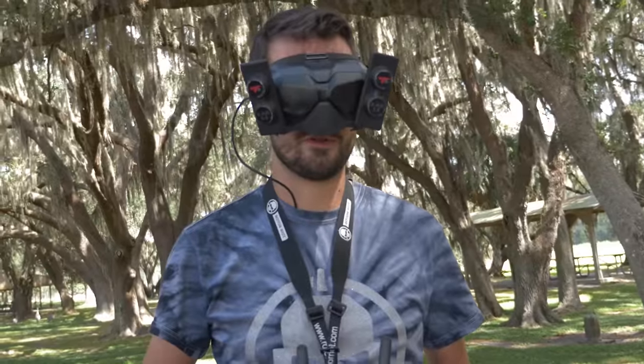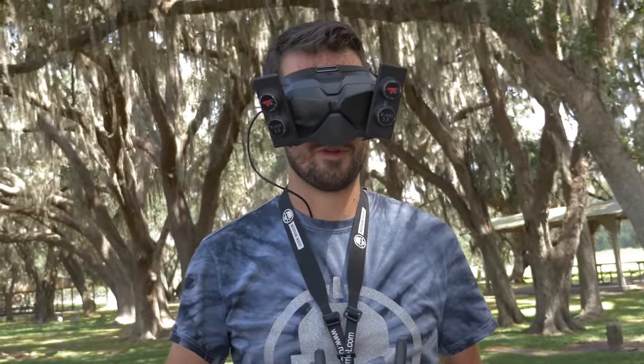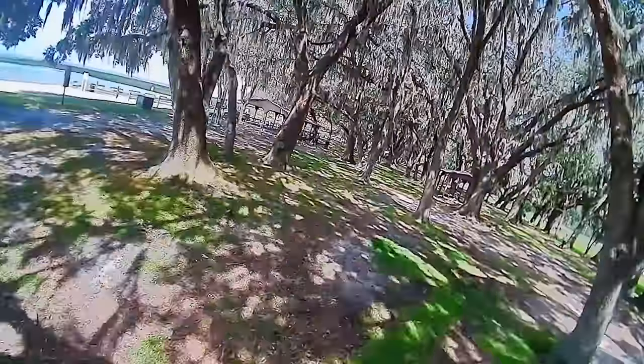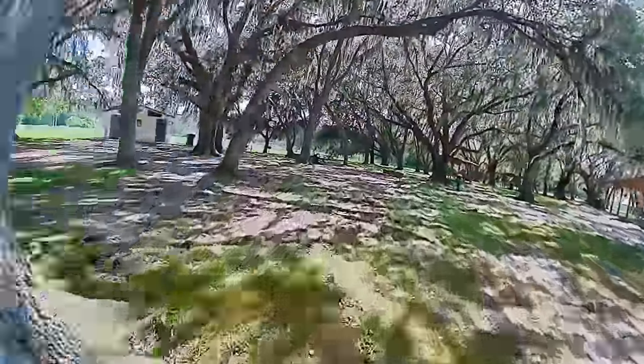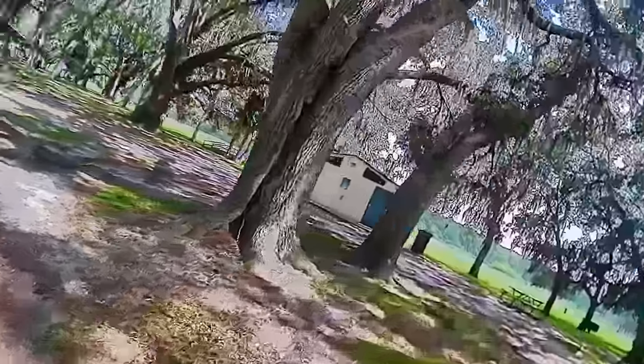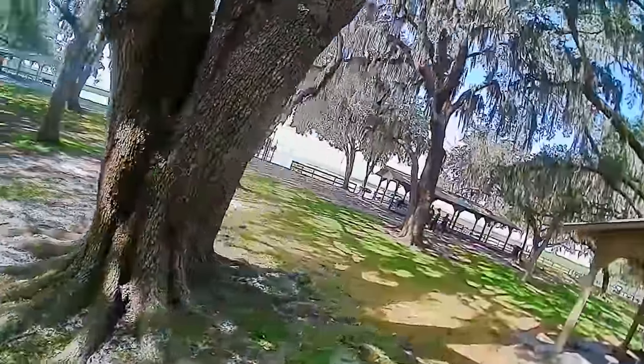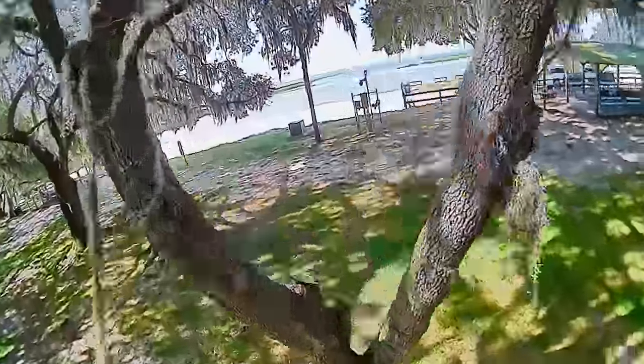So this was fully charged when we started. I'm already down to 15.3 and I've only been flying for about 57 seconds. So I don't know how efficient it is. I think it's all right. At full throttle, it sagged down to 14.7. That's not bad. So this is when you just send it and start doing tricks? No, I'm just doing a shakedown run. I'll let you do the first trick. I'm just flying through some gaps.